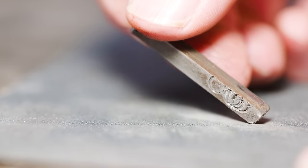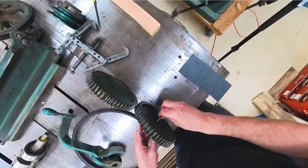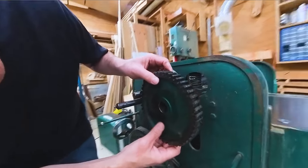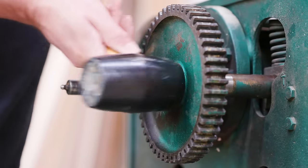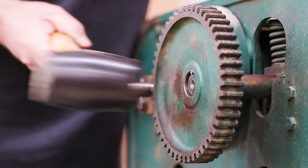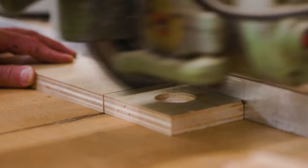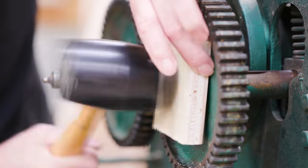I sanded down that little bit of damage from the set screws just to make the keys a little flatter, then put the key back in the gear. This gear that was hard to get off is going in backwards, so I'm guessing it's going to be hard to get back on — and it was. With a little help from the mallet I was able to get that gear back on. I got the axle all the way through but couldn't get the gear on any further with the mallet because it was now hitting the end of the axle. I took a piece of wood and drilled a hole in it, hoping I could tap around the axle to get the gear on further, but this didn't work. I'm wondering if I never got the hole I drilled centered — I really should have drilled it all the way through so I could see what I was doing.